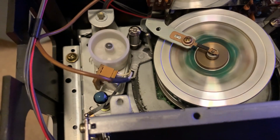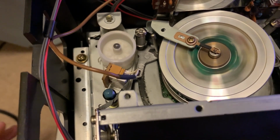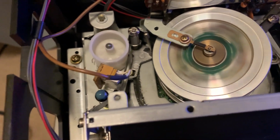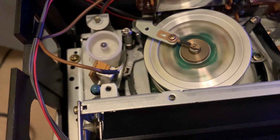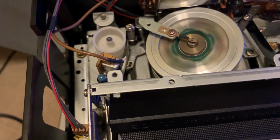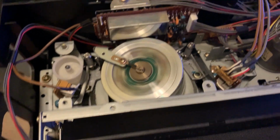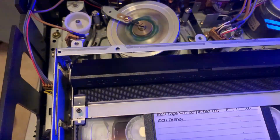But as you get into the 90s, it was omitted on a lot of machines because by then people were using newer TVs that had the horizontal circuits adapted to handle unstable time bases from VCRs better. But this is also important when you get dub tapes. You don't get any problems with that either. So again, another good design cue there. So now I'm going to hit stop.